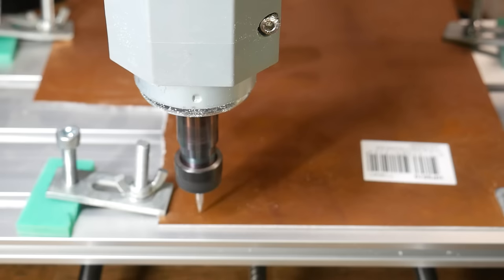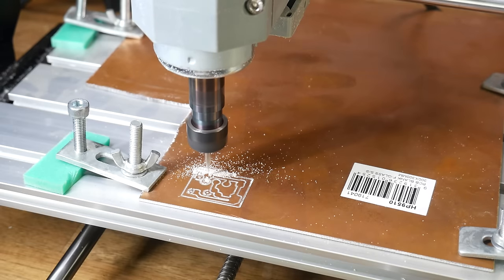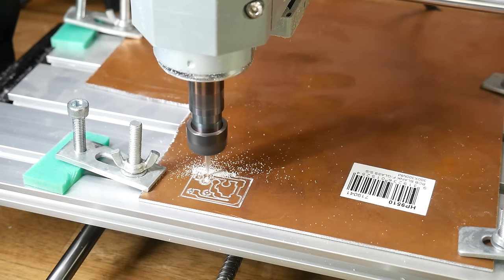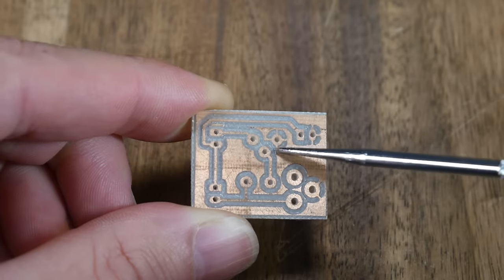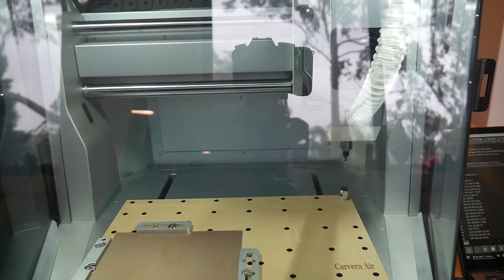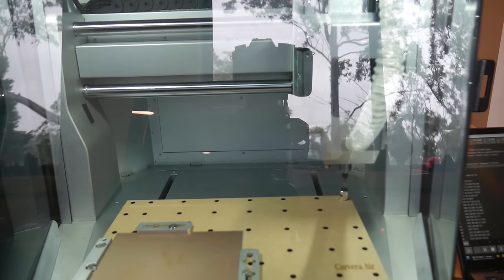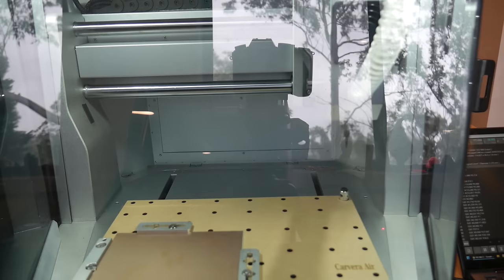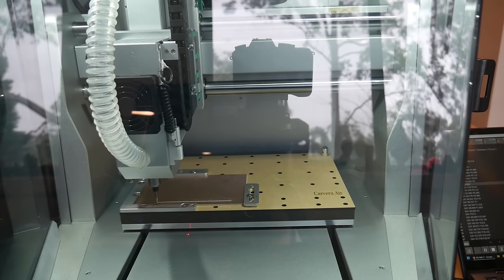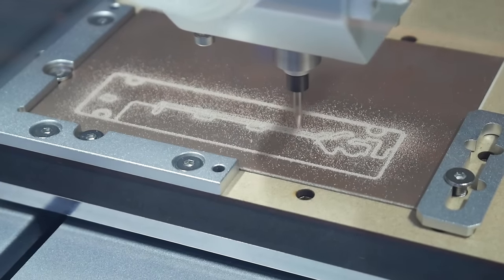The Carvera Air also has a probe that works exactly the same way. It has a laser to trace out the bounds of the toolpath, before probing the Z-height of a range of points in a grid. The only difference is that this one, instead of being wireless, is wired, and once we're finished with it, it's got a little dock that it slots into on the side of the toolhead. So workpiece probing is different compared to the Carvera, but simpler and functionally identical. On both the regular and Carvera Air, the tool offset is automatically calculated by touching down on a button in the corner of the bed. Combined with the probe measuring the top of the workpiece, this ensures very accurate depth of cut, even across a warped or uneven surface.